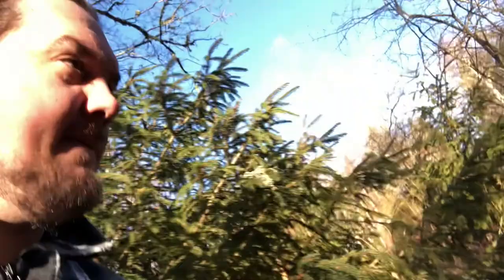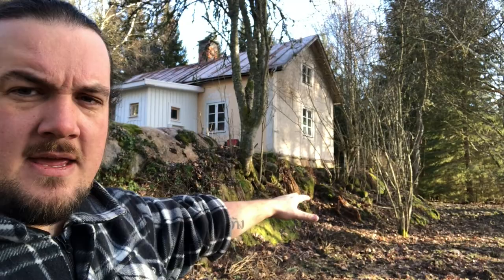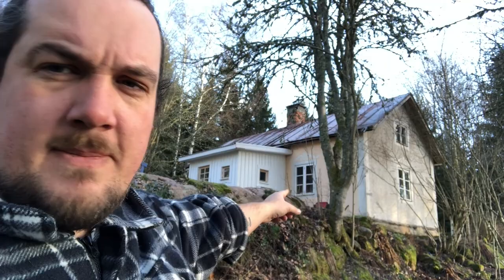I'm going to be building like over here where the bores have been. I'll just take you up here. So I think down here would be a pretty good place for some sort of water treatment shed. I'm thinking dig out a bit, put down the granite rocks that they use for foundations in this area, and then build a platform on top of it and get a few thousand litre tanks. And then I have a different well pump that I'll put in there, run it through the UV and a ceramic filter, and then into a fresh water tank, one of the 1,000 litre tanks as fresh water, and then have a separate system that pumps it up into the mudroom. And the mudroom's the only place that's going to have running water, because I don't want to go through beams into the main cabin.